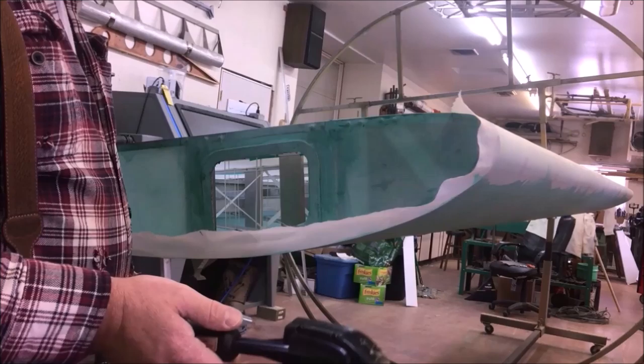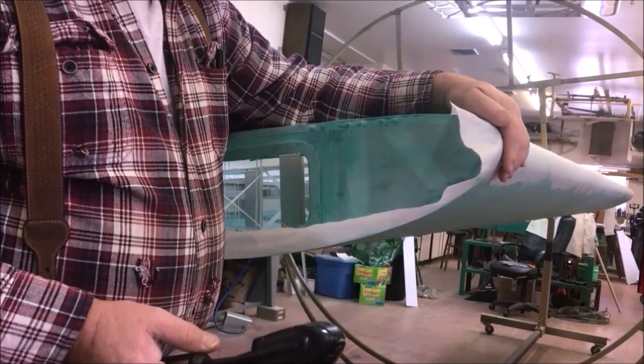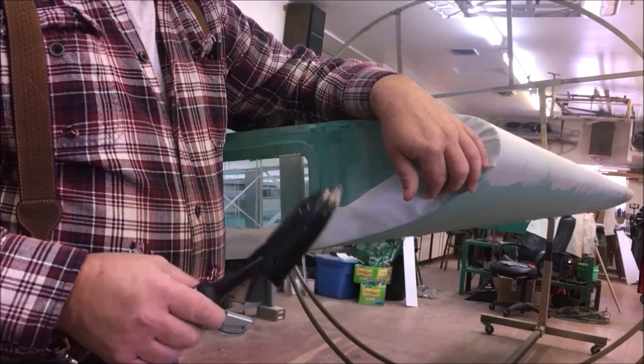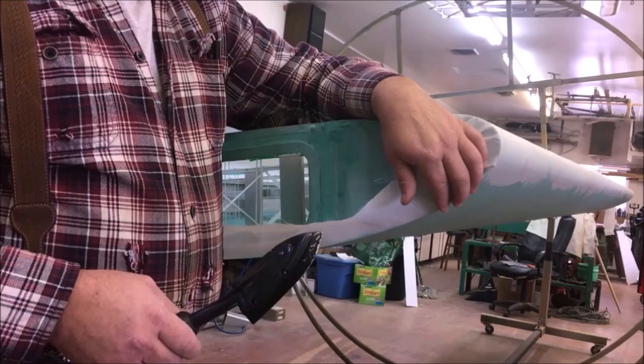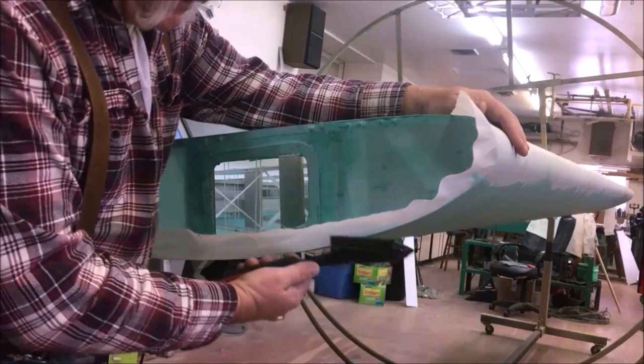So at any rate, we're on the end of this, and we could slice this off even and just be done. I'm going to bring it around a little bit because I like to have my fabric wrapped around a structure if I can. Stewart's is legal not to be wrapped around a structure. It's legal to actually do a repair, a glued fabric to fabric seam over an open bay. None of the other systems can claim that. Our cement is that strong, our adhesive. Anyway, always when we're working with this, I bring it in and I roll everything over the edge if I can.